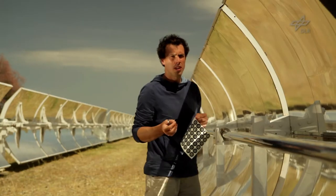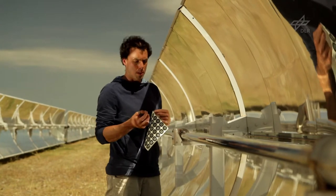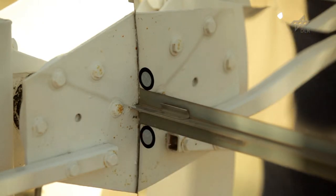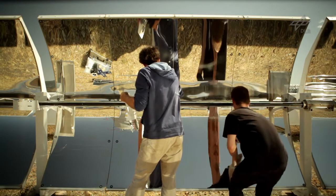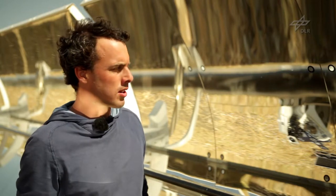If we have to attach targets very close to each other, it is very important to keep a minimal distance between them. The next target should be at least 50 millimeters away from its nearest neighbor. In the theoretical unit belonging to this measurement I will talk about the relevance of the position and the positioning accuracy of the targets.